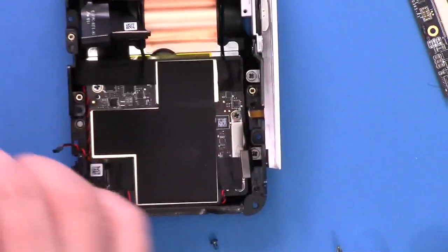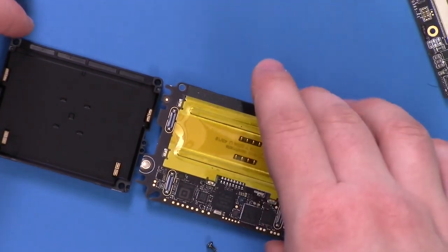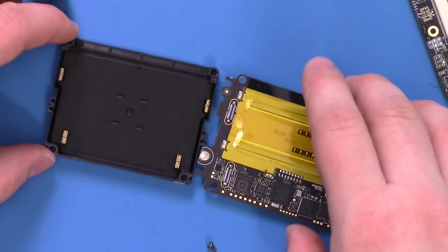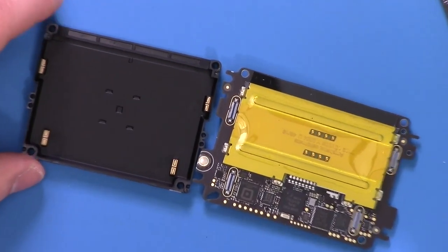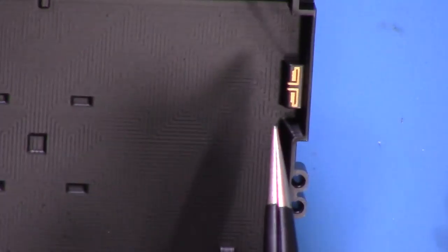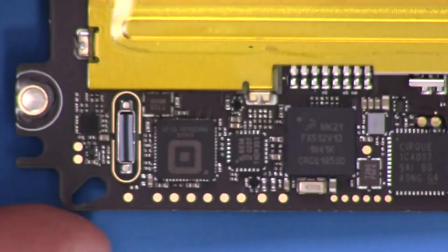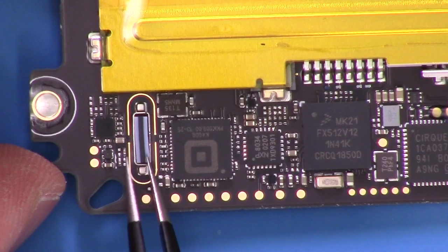Now we're getting into the fun stuff. I'm going to make a bunch of wild guesses here. I believe this is the security boundary. What you can see - this just got a thousand times more interesting. There's actually a pattern in this smart card cover here, and it's going to these pins. The idea is the pattern goes in some way that is difficult to bypass. They're using these zebra connector modules here - it's not even specific pins. These are basically conductive strips - LCDs would use these previously.